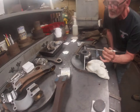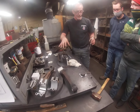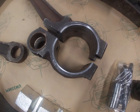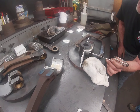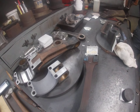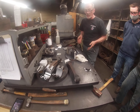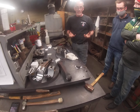See the felt is here and here — on the corners where we changed the configuration. We went from these liners back to the original, which was all babbitt, so we milled these slots in here to give it a nice anchor and a nice face. These holes are so close that sometimes babbitt leaks through, so the felt is in there. What we do with the babbitt stick is take a little torch and puddle certain areas to build that up, then take it flat so it's nice and clean and square all the way around. Then it goes to the mill, we rough it out, bead blast it to make it nice and pretty, and sonic check all of them.